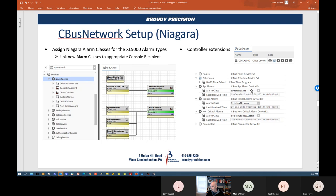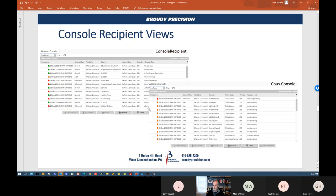Going to alarm service in your normal services on a station, I added system alarms, critical alarms, and non-critical alarm classes to match what comes across from CBUS. On each CBUS controller you can expand sys alarms, critical alarms, and non-critical alarms — there's an alarm class slot where you select which alarm class in your alarm service you want those alarms to route to. I have each routing to a separately assigned alarm class and created a separate console called 'CBUS Console' so you can see those points separately. When those alarms come in, there are alarm text messages — things like B-port change messages and points in manual, the same messages you would have seen on your XI 582 where you'd hit C to clear.